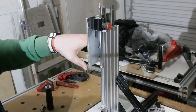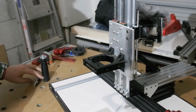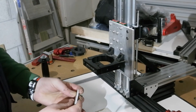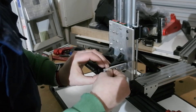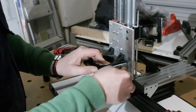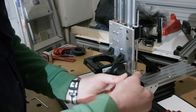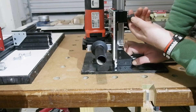The final touch is adding a handle to the motor mount. These OpenBuilds mounts have M5 tapped holes all around - I'm using the two on the side. I cut and drilled a piece of plate for the task; for best fit, two 20mm M5 screws with an M6 nut over them act as standoffs between the plate and the mount. The hole in the centre I drilled and tapped to M10 to accept this angle grinder handle - I'd upgraded my grinder's handle so it won't be missed. The thread goes right through the plate, hence the need for the standoffs.